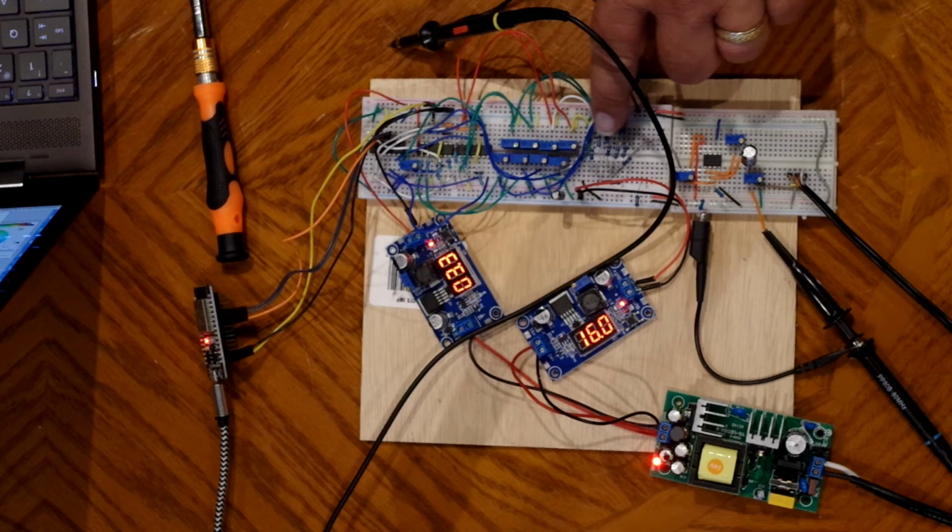That means that if channel 1 is going to be running at 3 volts, then if all of the bits were added together they would be running at 6. So if they were all high at the same time, the voltage coming out the other side of that resistor network would be 6 volts. So you want your most significant bit to be half of the total potential of the DAC. And that's what these voltage dividers are doing here: controlling the voltage that gets sent to the summing amplifier when the bit is high.